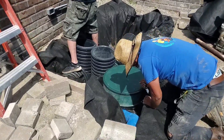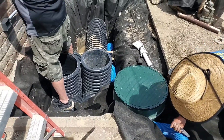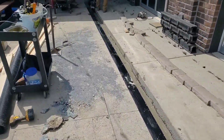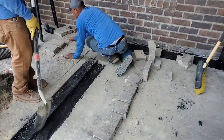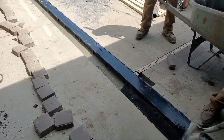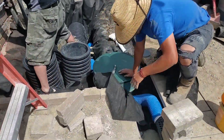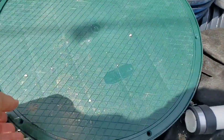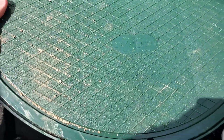We have it going to a distribution box — the green lid that you see is what's known as a distribution box. You can see we have a roof runoff pipe as well as a channel drain pipe feeding into it. The men are putting in sand slag so that we can start laying the brick pavers. We're going to do a soldier border of brick pavers as it was originally done. We do have some leftover pavers because our channel drain is so much bigger than the microdrain.